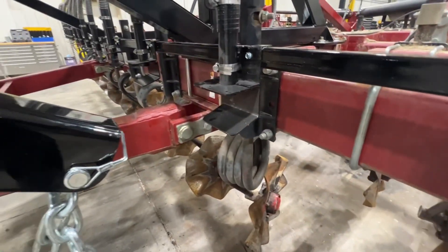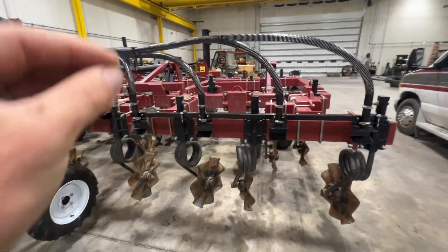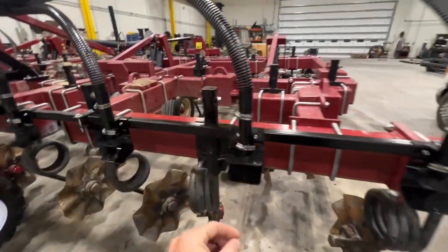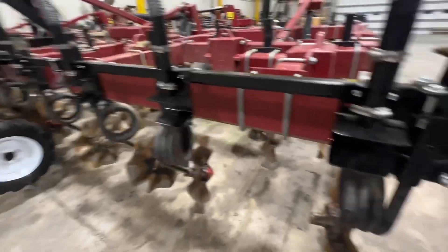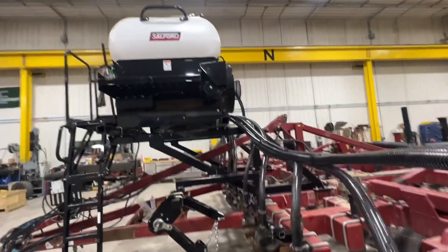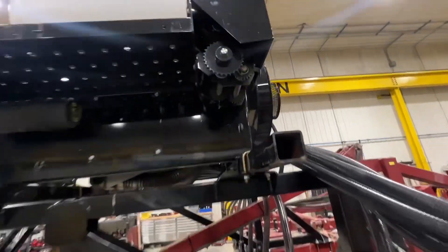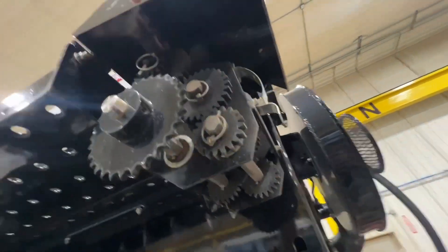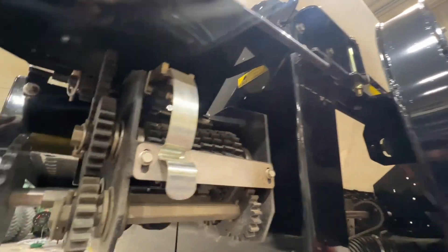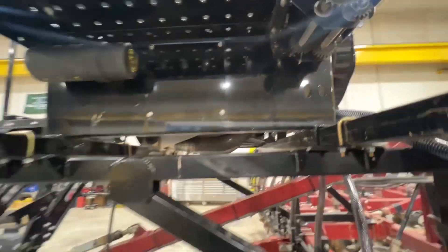These tools still have an awesome place — one of those places is seeding. They're phenomenal for seeding cover crops, alfalfa, wheat, rye, barley — you name it. They've got a hydraulic-driven fan out the back, and this one being ground drive has the meter box with all the gears and adjustments on it right here.